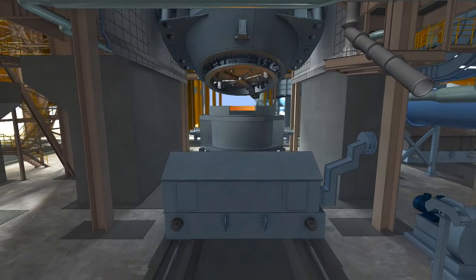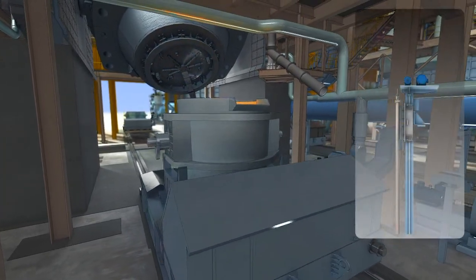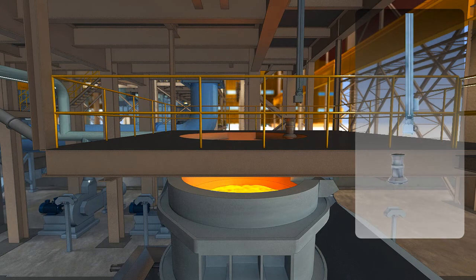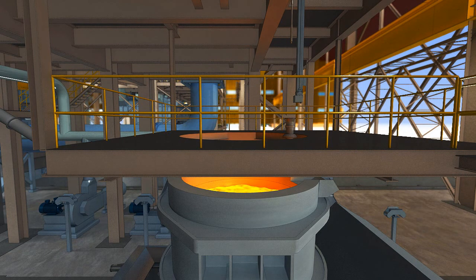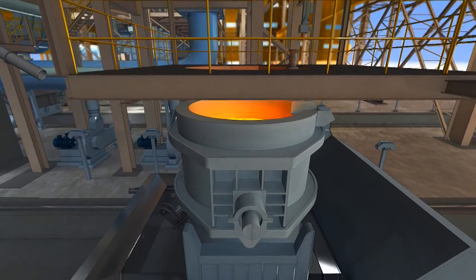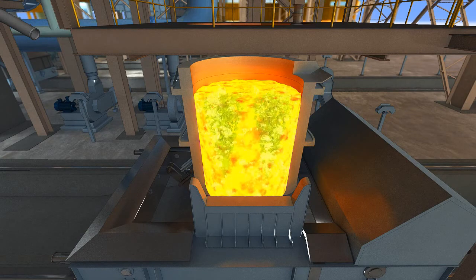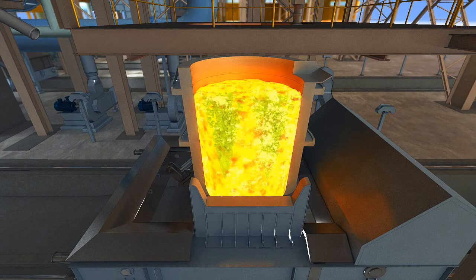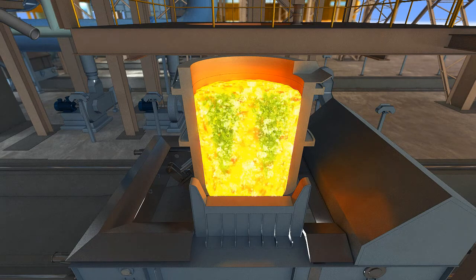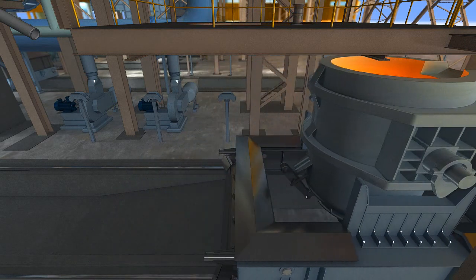The converter is tilted back to 30 degrees towards the charging side and stands by. The teeming ladle transfer car is moved to the ladle bubbling area. In the ladle bubbling area, the lance for temperature measurement is mounted with a probe for temperature and sampling and is operated manually. The lance is descended to sample the molten steel and ascended after checking the temperature. The probe is detached manually, the sample is cooled with cooling water, placed into the sending device, and sent to the analysis room. The bottom gas at the bottom of the teeming ladle is then used to perform bubbling for a set period to equalize temperature and homogenize the ferro alloy. The teeming ladle transfer car is then moved to the secondary refining bay.